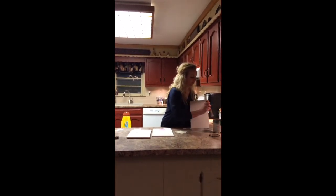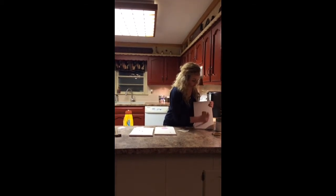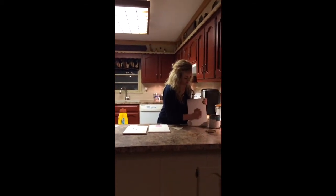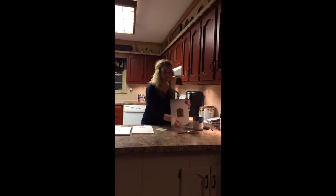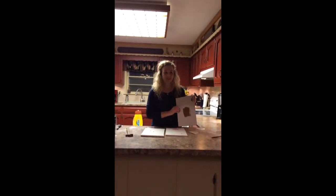Lastly, paint over the patch area if you want. And that is how you fix a hole in drywall. Now let's go over what we have done: it starts with cleaning the hole, then the patch must be cut and placed, after that the mud must be applied and smoothed, and finally it must be sanded and painted.